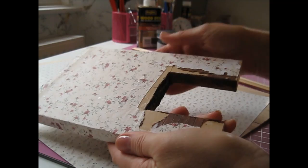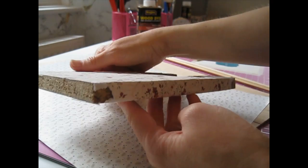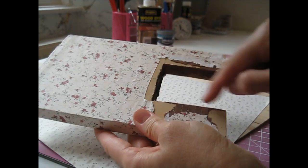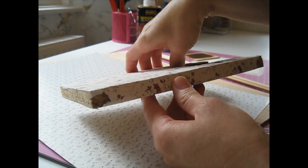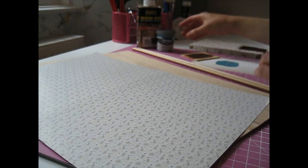I'll strip all of the paper off the chimney breast. When I tried it back in the room it was a little bit too tall. It's MDF - I used a piece of shelf from a unit we dismantled and cut a section out. The MDF has probably just swollen since I took it out, so I'll need to shave a little bit off the top.